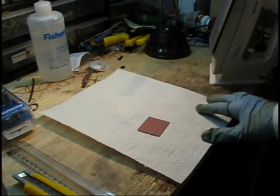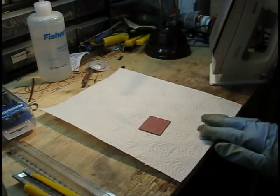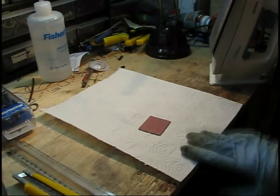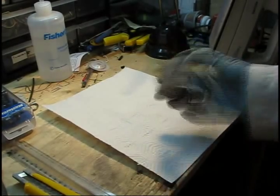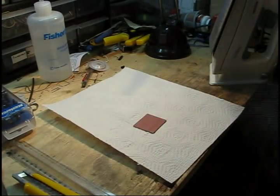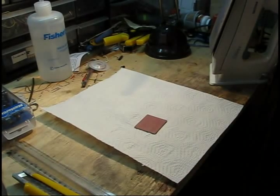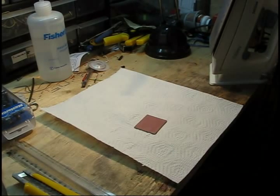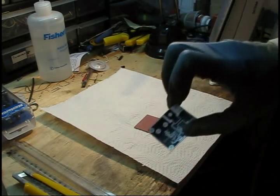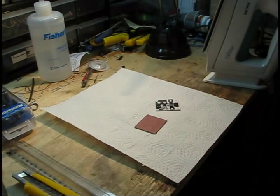I've noticed that if you work on a plywood workbench, or anything that isn't metal or ceramic, any tree sap in the wood will actually transfer to your board, and if you're doing double-sided boards it will prevent the reverse from etching. We're only doing single-sided here, but paper towel is acceptable as a surface to place between the board and the table. You also want to have your PCB artwork ready, prepared, and cut out, and the iron is ready to go now.